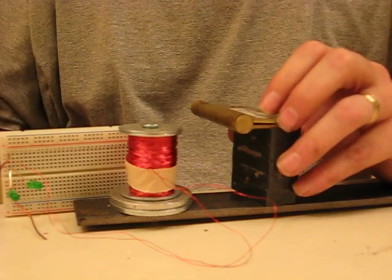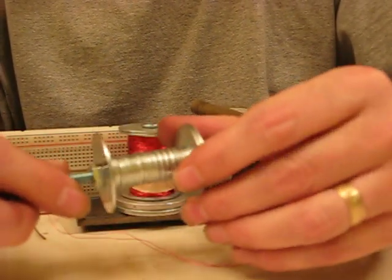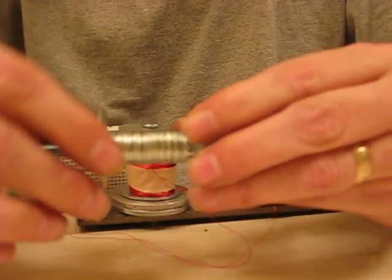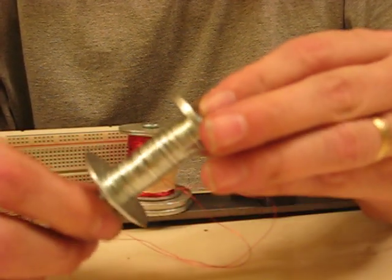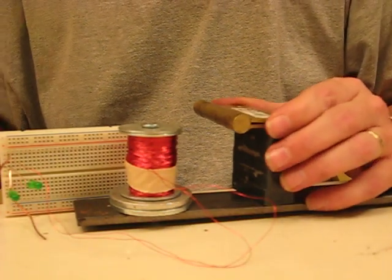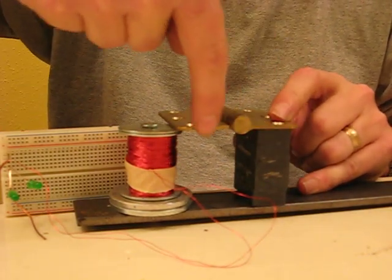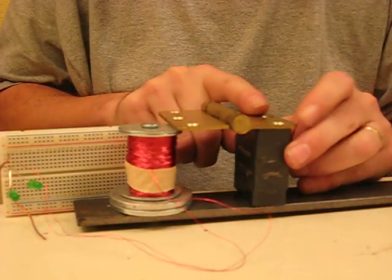You may wonder how I made my coil. There's a steel core, and the way I did that was just using hardware store items — just a bolt, some small washers to form the center of the core, and some larger washers to form the ends of the spool so I can wind the copper in between. It's important to have an iron core so that when I close my magnetic circuit, everywhere that the flux flows is through steel. Having a steel path allows me to get the most out of my magnets.